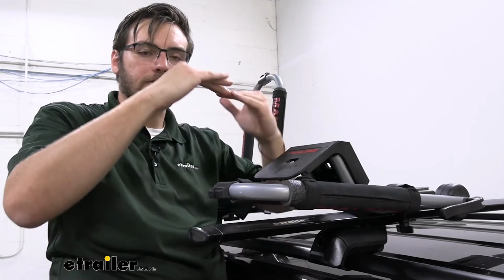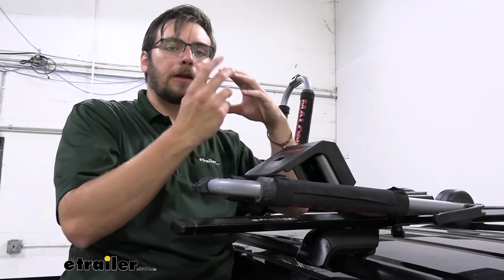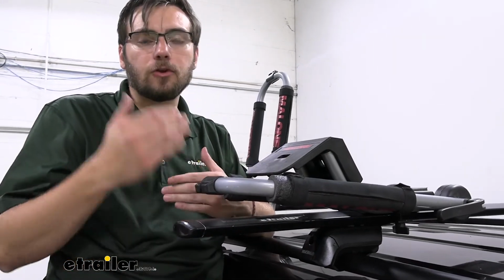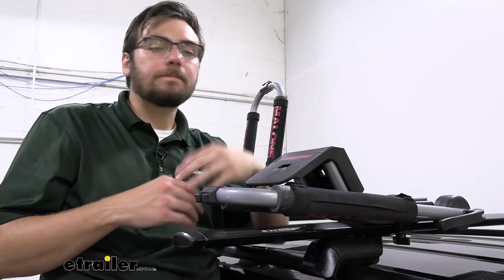Otherwise, you're gonna have a kind of hilter-kilter plate, and that flange is gonna have a hard time going into place. So all you gotta do, bring both those bolts down, bring them back up, tighten them on. It doesn't take more than 2 minutes for each side, which is great. The only thing with it could be kind of a pain to have to do it over and over again.